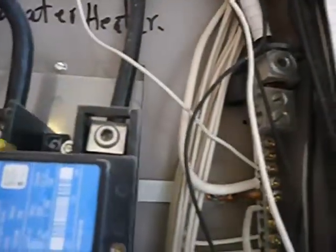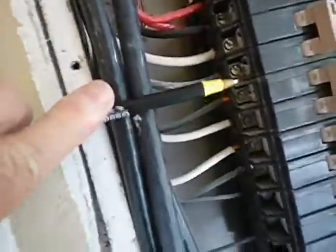If these panels were installed today, then you would have little rubber boots on these. This is a safety feature, so I'm going to say it on the report, but it wasn't required when it was built. And the grounding location is labeled. Now, these cables are not supposed to be in direct contact with the panel cover. They're not supposed to be touching the panel cover. So we got a problem there. No problem here. Problem there.